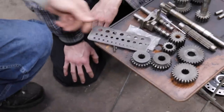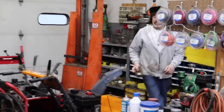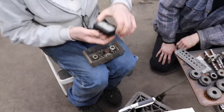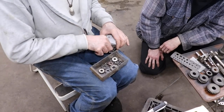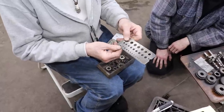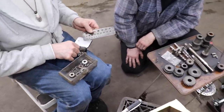So I have a little container over here that whenever I have old ball bearings and stuff that fall apart, I save all those ball bearings that come out of there. You know how you got ball bearings that come apart? Oh yeah. Not all of them are bad. So I'll go through here and I'll find me two new balls to replace. Here's one right there, quarter inch. Nice new shiny one to replace those pitted ones. Sure there's another, yeah, that looks like one right there.